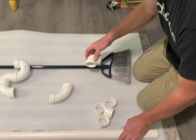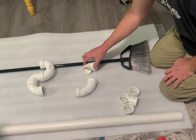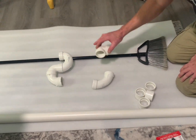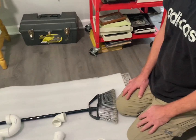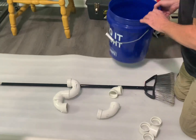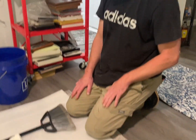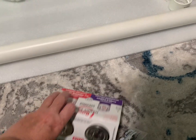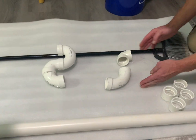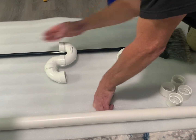Your family's been in the tile business for almost 100 years. But when my daddy did plumbing, it was not plastic. What was it when he did plumbing? You can never say that — that shows you don't know what you're talking about. Any type of drain is going to be PVC. Not back in the 50s or 60s — that was cast iron. That's different. The hard part is because the pipe is straight. We have to bring everything up, turn it over, back in, put the P-trap on, and shoot to there.